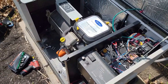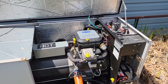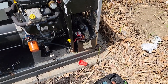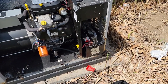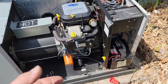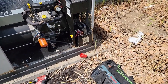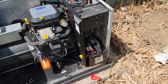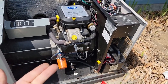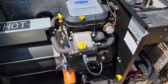The only thing left to do now is test the transfer switch to make sure it's actually going to transfer over. It doesn't do them a whole lot of good to have a generator running if it doesn't transfer. Let's do a rundown - we've taken care of the battery, confirmed the water levels are correct, made sure the specific gravity per cell is the same so we don't have one cell failing. We've got good connectivity on our battery terminals and treated them. We checked the spark plugs and made sure the gaps are correct. Prior to that we checked our compression. We checked our battery charge circuit and tested the battery under the electronic tester. We've made sure our gas pressure is right. You've got to have spark, fuel, and compression - just take your basics.